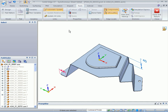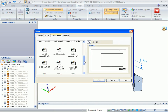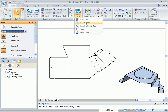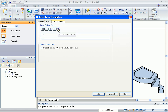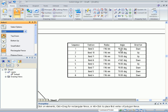Now we want to create a drawing. To create the drawing just like before, come up here and select New, Create Drawing. Browse to a quick sheet — this one is called Sheet Metal Draft. We don't have a difference between first and third angle because we're not pulling any views, so just use that draft template. This places the flat and also an isometric view. You can then place the bend table onto the drawing view. In the options, you can add a title and bend callouts — you can see that we're calling out the bend sequence. In this case, we're going to place the bend callout inline with the centerlines, and you can see it adds the bend number and sequence number from the table.